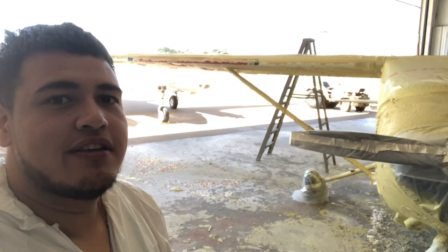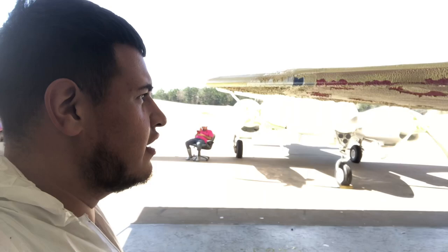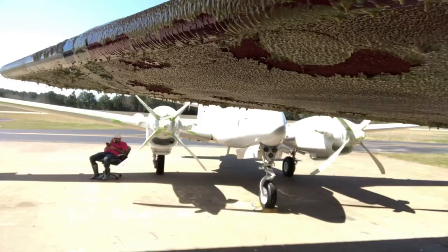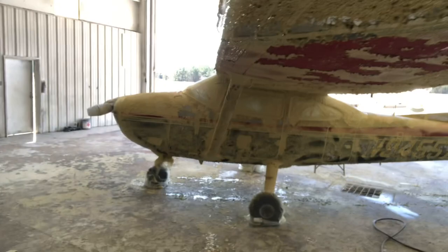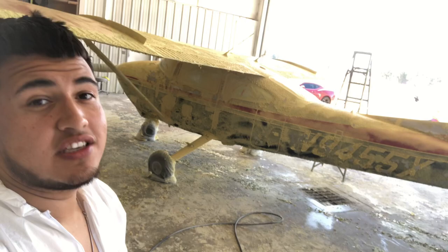Look, let me go ahead and show y'all something crazy. Y'all probably try to listen to it. It sounds like crispy rice cereal. I don't know if y'all could hear it, guys, like the stripper acid is doing its thing. And if y'all are wondering what type of stripper we are using, T30 right now at the moment for the Cessna 182. As y'all can see, it's currently been maybe at least 40 minutes since we laid down the stripper. And guys, let me tell y'all, it's doing its job.